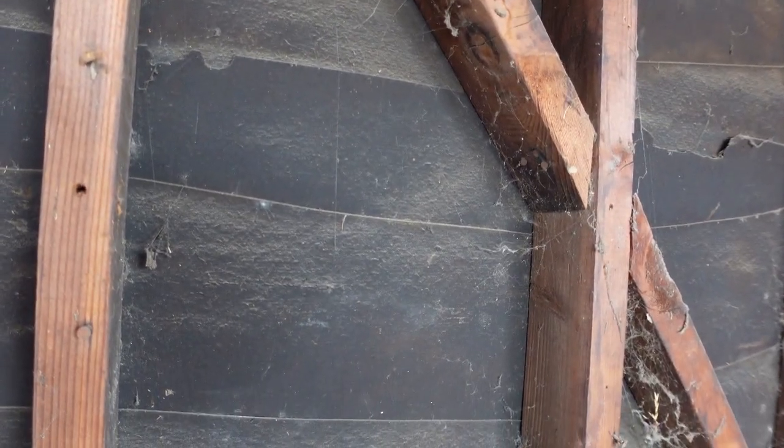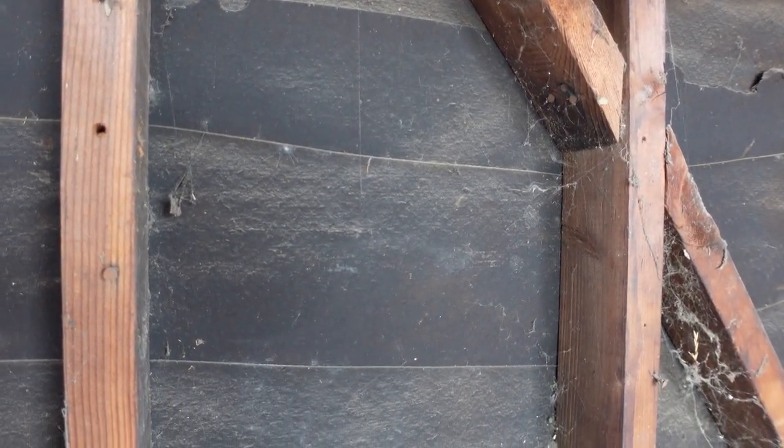This has to do with asphalt saturated paper, which is essentially a moisture barrier that's applied right before the stucco is installed. I'm going to show you the garage for this property so you have a visual idea of what I'm talking about. I used this strategy on my personal ADU and it's also been used on another property that I'm going to show you as a live example — a proven method signed and approved by the city inspector. We were able to pass the inspection and move to the next step without a problem.